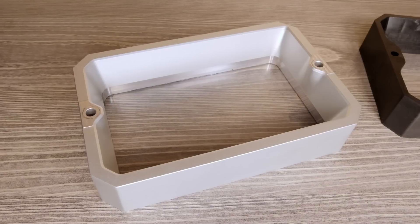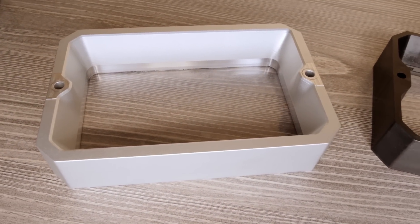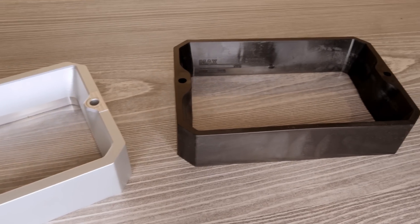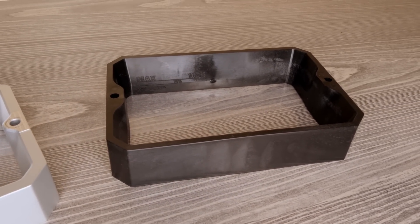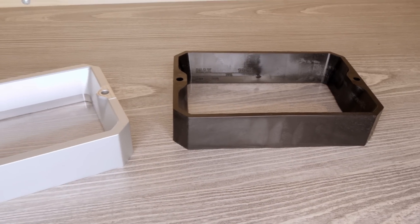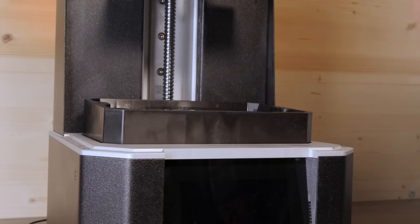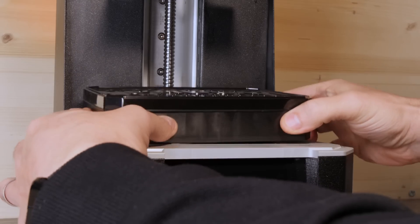The VAT on the SL1S has been swapped for a plastic injection molded one, as opposed to the aluminum one that was on the SL1, mainly to be able to increase the speed of the tilting mechanism. This in turn made replacement VATs cheaper — half the price actually — so I could buy a couple more in order to swap out VATs with different resins inside to save time cleaning each one. The VATs also come with a handy cover to safeguard the resin inside.